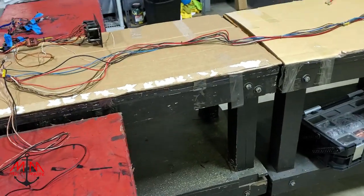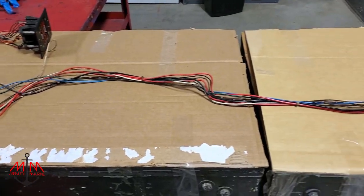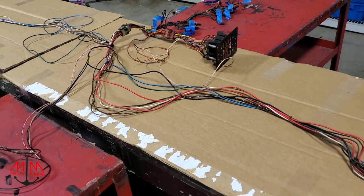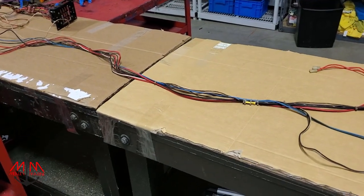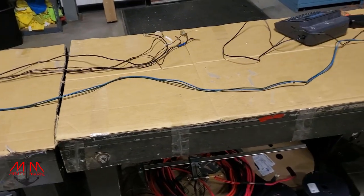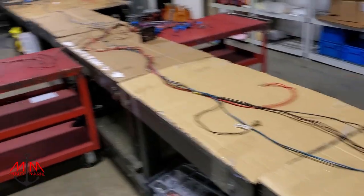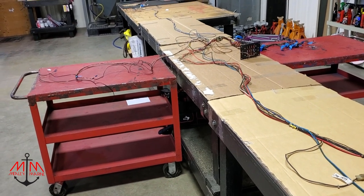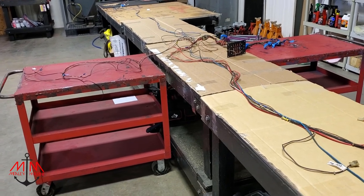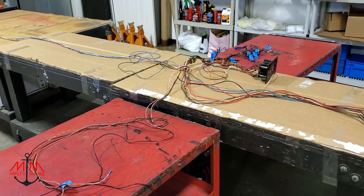We're going to go ahead and replace the whole thing with new wire. If you don't have a wiring harness, take some string, lay it out through the boat, and label each piece of string so you know everything is accounted for. The last thing you need is to forget the bilge pump switch up at the front of the boat. Take the time to go through it. We'll start at the front, label each wire, work our way back, make sure everything is labeled, then take out the unnecessary cables.